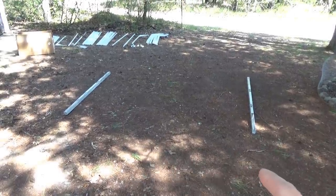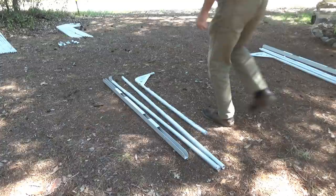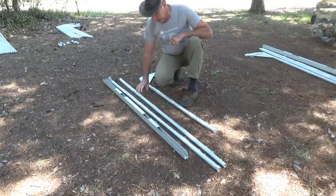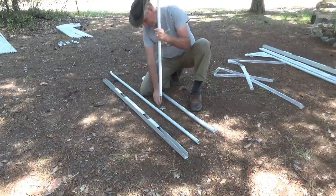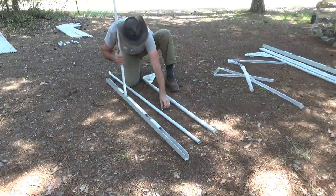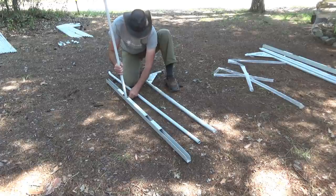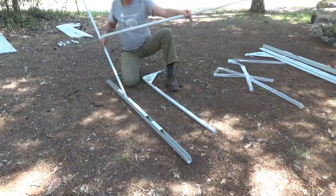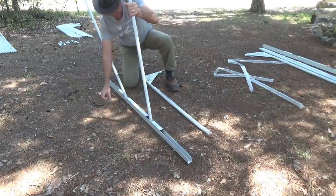Now you take your left and right base pieces and lay them out in their permanent location. Now you connect. I have MCR 002, 003, and 004. I'm going to start on the middle frame pieces, and I've got the same on the other side with the L's. Put the bolt through and put your nut on. Well, this one has a curved side, which is going to face towards the other pole. Very important to pay attention to that when you put this on.